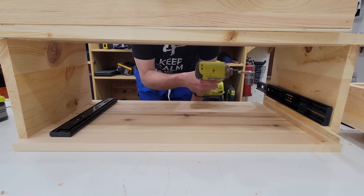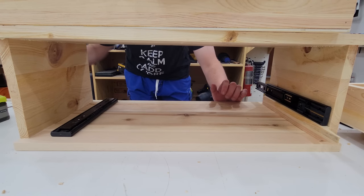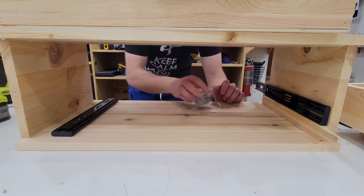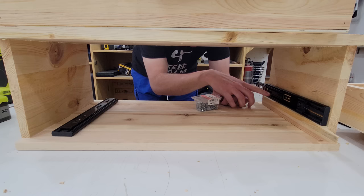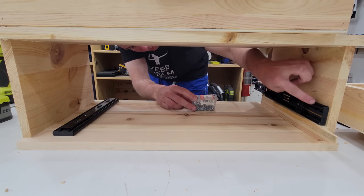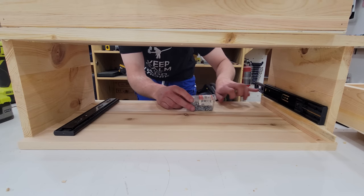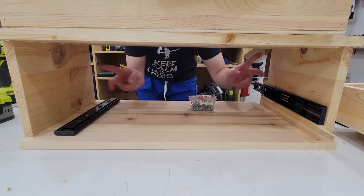But yeah, with real wood, you don't want it to split, so we are going to have to drill a pilot hole first, and then we'll drive in our 5/8-inch screws. We'll use just button head screws here and here, but we'll have to use this countersink head in the back as it has a bit of a deeper hole and it's just not going to work with the regular button head screws. So 1, 2, 3, we'll do that for these four drawer slides.